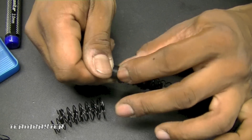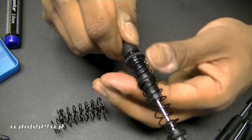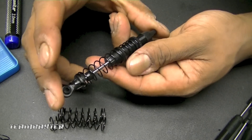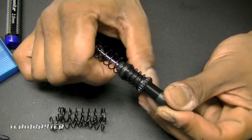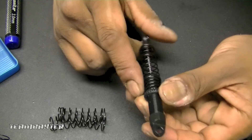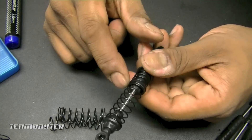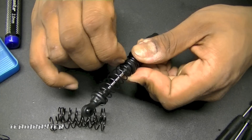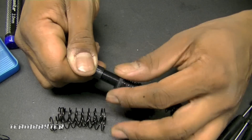At the fully open position the shock and spring are moving a little bit, so I'm going to back it down just a little bit so that the spring catches. That's where I'll leave the fronts. The rears I'll probably compress almost all the way. That adjuster's really loose — I don't know if that'll stay in place very well, but we'll see. I'll push the rears almost all the way down. It's got a good action on it. The separator rubs on the springs but that's typical with this sort of shock setup.